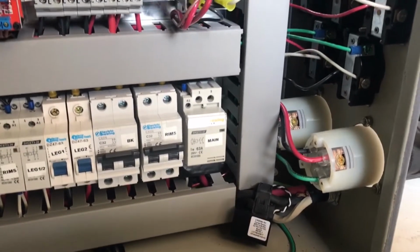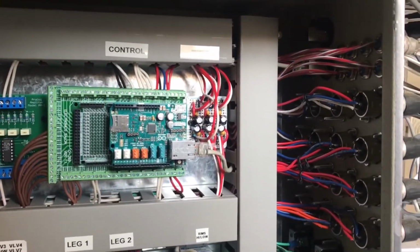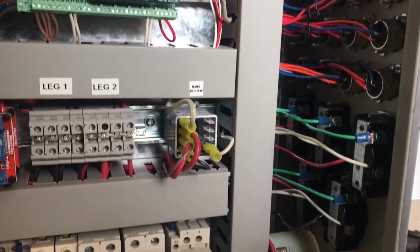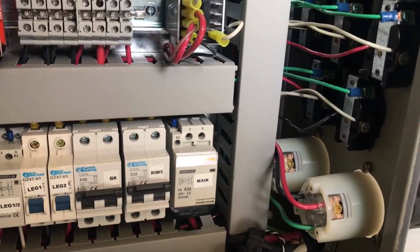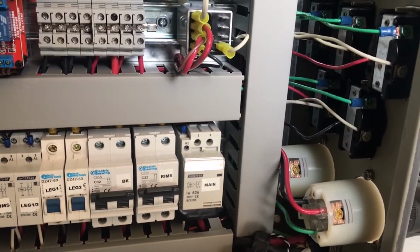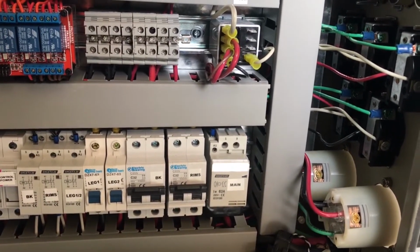The right side of this controller contains the power and I/O connectors, and I brought them out through the side to give the ability to mount the controller underneath the brewery. And we're going to do the same for this build. When the connectors come out the bottom, you're really limited to wall mounting for the enclosure only. And one of the nice things about this enclosure is you don't have to have it accessible to the user because all of the controls are done in software on the computer.